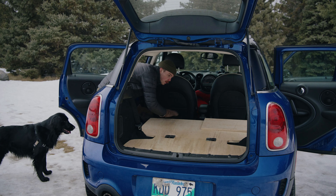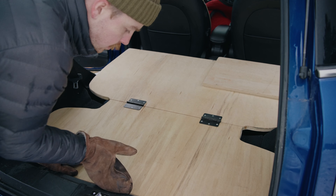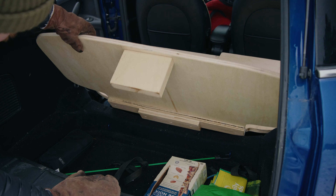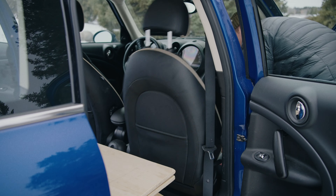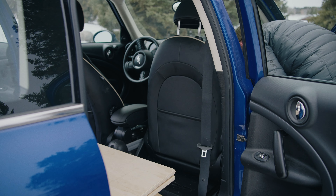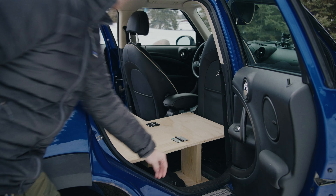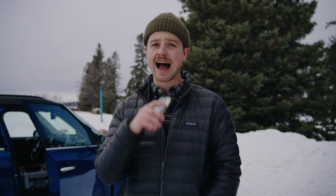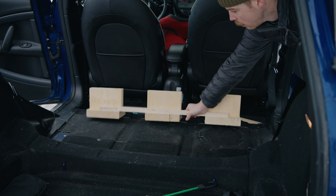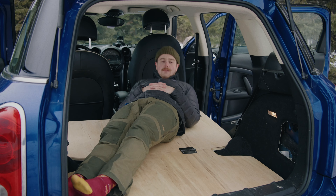Once I had the fit-in structure, I cut the plywood in half so I could fold the pieces onto each other, making it easy to take in and out of the car and easier to store. I then attached the hinges at the exact point so it folded nicely and evenly. I sanded all the edges of every piece of wood to make sure there were no sharp edges that could ram into the car. I also created a flip-down headrest section using the other hinges and another piece of plywood that fit perfectly for my needs and now hinges down with support. To make sure everything was level and supported, I used 2x8 blocks and some scrap wood to figure out the right placement and height for the supports throughout the vehicle. I then stained the wood with a clear stain to protect it from the elements.